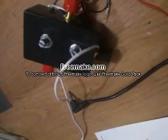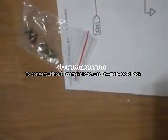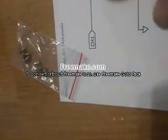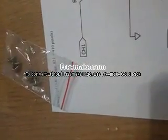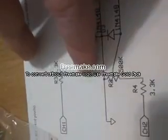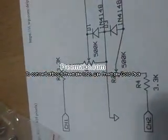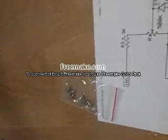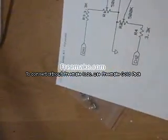The thing is, with doing it with a multimeter, you're going to have problems because of these resistors that are connected to it. These pots are interconnected. R1 and R2 are connected in series between the metal part and ground. They all share the same ground. That means if you're trying to measure from, let's say, this one here, it'll go to there, even though it's supposed to be this one here. It's because current will flow through the shortest path possible. Anyway, enough said about that. Let's go test it with the oscilloscope.